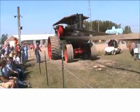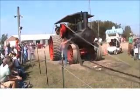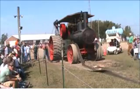The way that works is that the harder you make it work, the more the governors open up and the more steam it gives it. And the more steam it gives it, then the more it goes up the stack, and the harder it makes the fire burn.